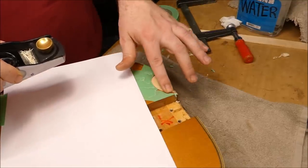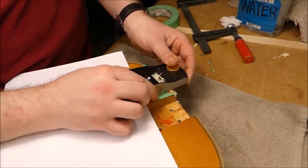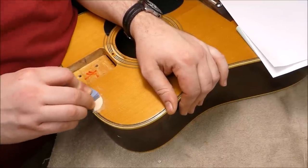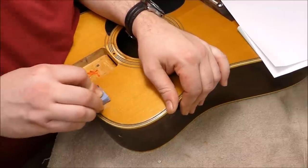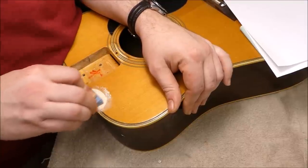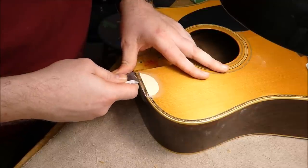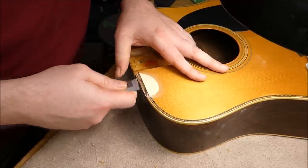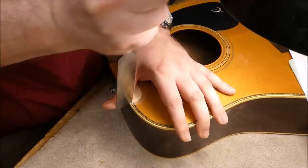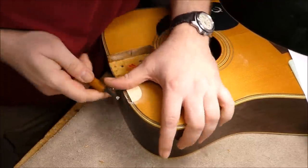There's just enough material to inlay. I planed that down after gluing it in place with some hide glue, protecting the top with some paper and tape, and then trying to sand the transition between the two surfaces. Next, I want to clean up the channel here so that I can glue on a piece of spruce that will act as a bit of a platform for the purfling lines and the herringbone, because those aren't as deep as the channel for the binding. We'll square up the ends and try to make that pretty neat.